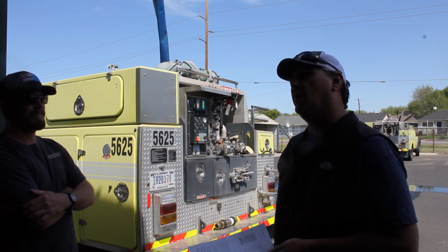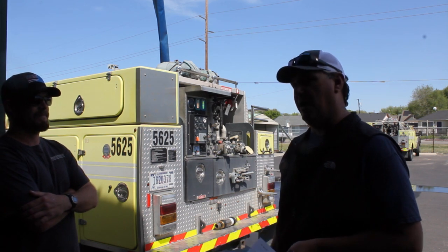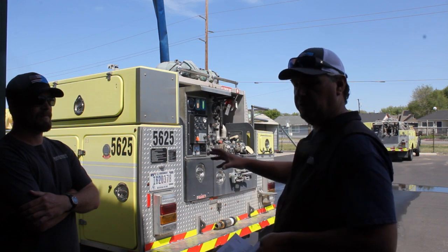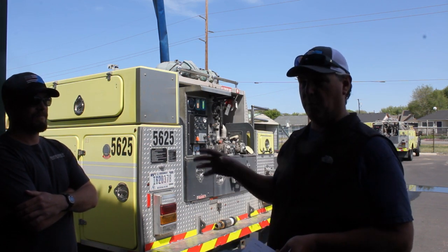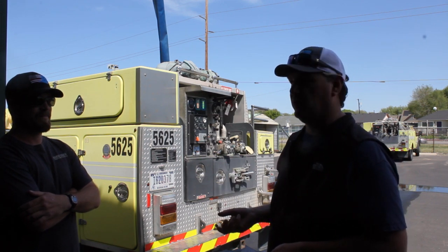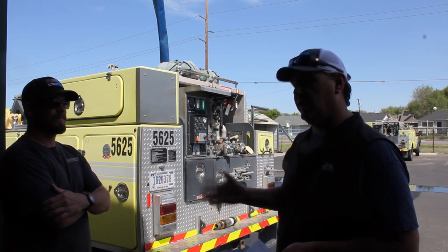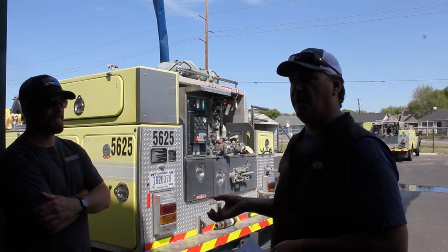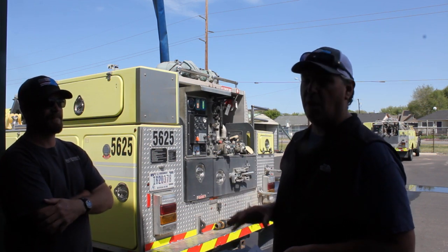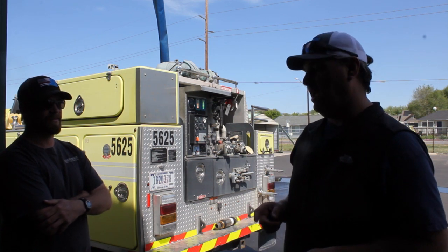Talking to them, the Darley AGE max performance isn't necessarily at max RPM. Using the nozzle, you need to have that known set point for where max performance is. Generally, that's at max RPM. That works with the BB4, etc. It does not work with the AGE. You have to crank it up to maximum RPM, then back it off a little bit to get max performance. So it's a little more complicated. It takes a little more time to pump test an AGE pump.